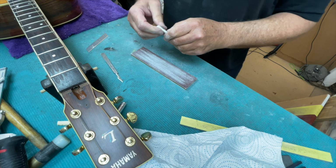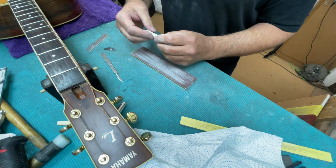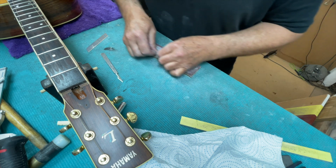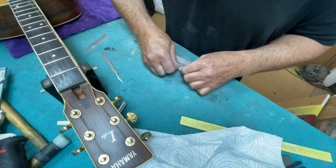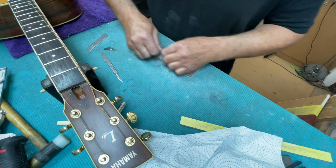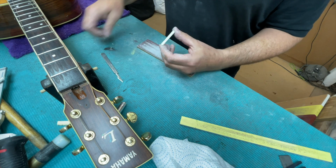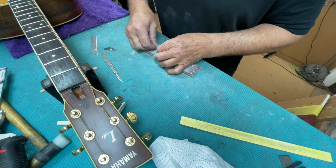Okay, so I'm still not quite flat on this side, but we're nearly there, and there's enough overall. We don't need hardly any lift from this, so I'm just going to keep working this until we've got A, totally flat, and B, almost exactly the correct height, and then we'll work the slots from the middle outwards. Okay, we're almost flat, but we're still sporting about 0.5 millimeter too much thickness on here, but that's okay. It's a sort of luxury position.